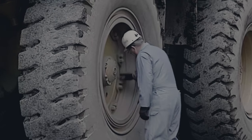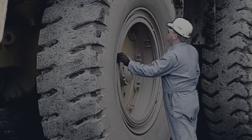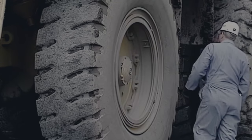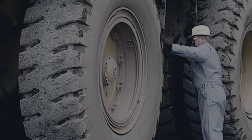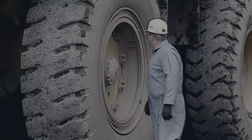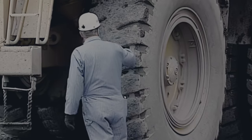You begin your inspection with a thorough check of tires and wheels. Look for loose or missing lugs or cracked or bent rims. Check the tires for exposed plies, deep cuts, bulges and abnormal wear. Also look for proper inflation because low tire pressure can cause poor steering response, overheating or a blowout.